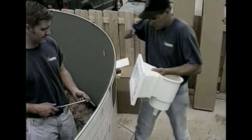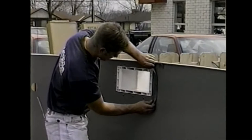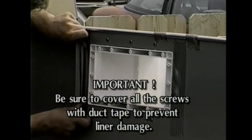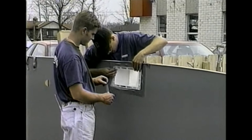The following special skimmer installation instructions must be followed prior to installing the pool's vinyl liner. Install the skimmer to the pool wall with 10 panhead screws using the outer set of holes on the skimmer body. Then take one of the gaskets to the inside of the pool wall, aligned with the skimmer opening.